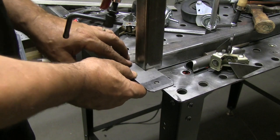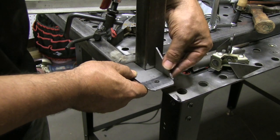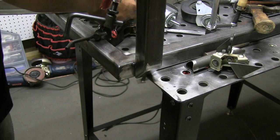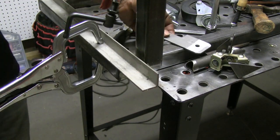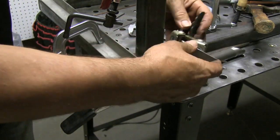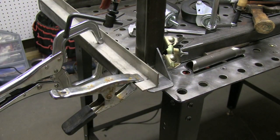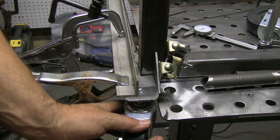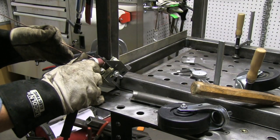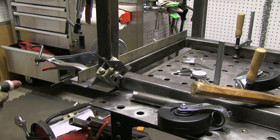Now I've got to figure out how to put the wheels on. I decided to use some casters I already have to save money, but they're kind of tall — they've got a post instead of a four-bolt platform mount. I don't want the machine sitting up too high because it's already kind of high and I don't want it top heavy. So I'm putting the top of the caster even with the top of the square tubing, making little brackets with a hole for the post, and I'll put some scratch start tacks on there while checking clearance first.